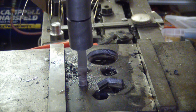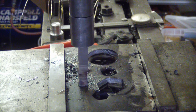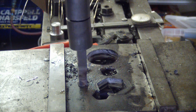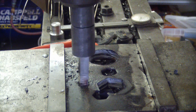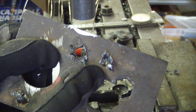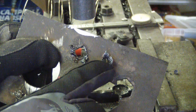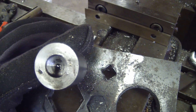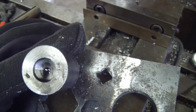Take it easy at the start until you can see it's in its track — you don't want it to try and walk around on you. Once it feels like it's in its track, crank up the speed. And we're through! There's the backside and that's the powdery looking chip. What's happening is that every time it does one rotation, it's taking a tiny little bite and forcing it down through. The next time you need to drill a non-round hole in steel, go ahead and impress your friends with your machining knowledge and knock together a rotary broach. Thanks for watching. Keep your stick on the ice.